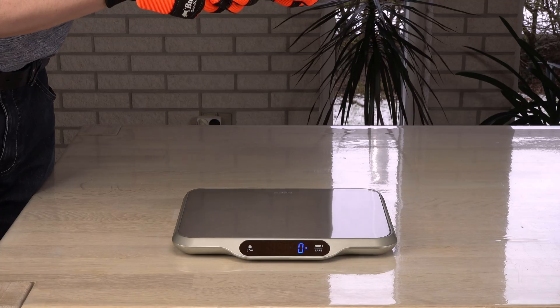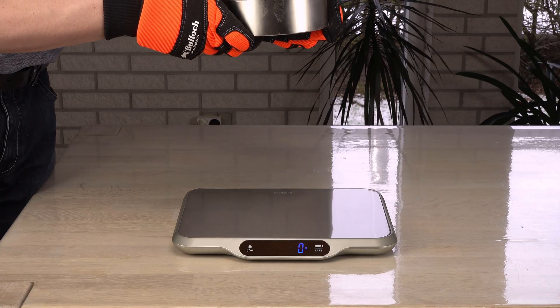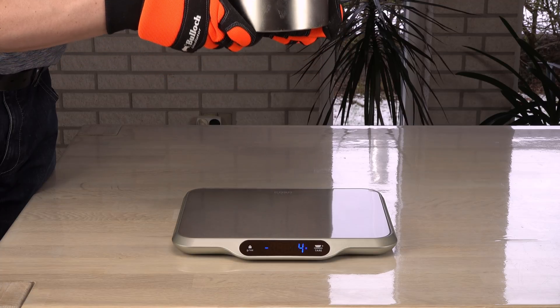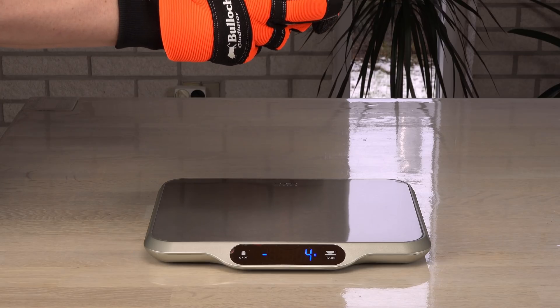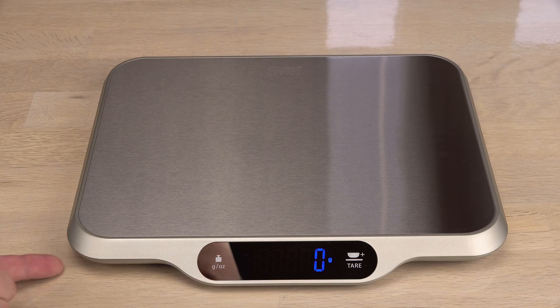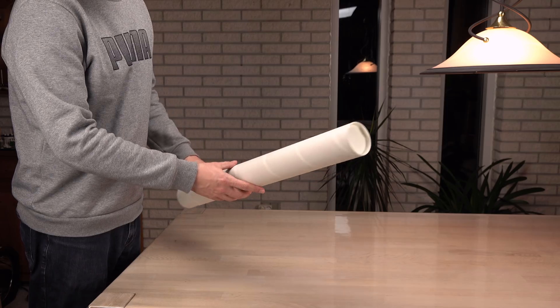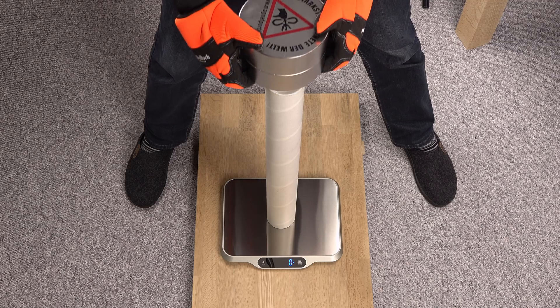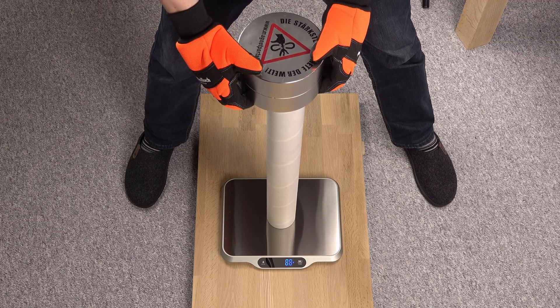Let's test from how far away the magnet will affect the measurement on this scale. Looks like around 30 centimeters — a foot. We see a negative number since the top plate is attracted to the magnet, lifted like here. I will double that distance and use a 65-centimeter-long spacer. This way the magnet should not affect the scale noticeably.